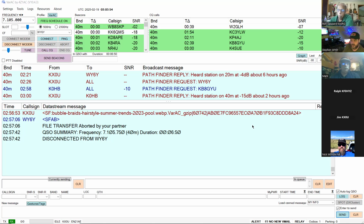But it's also useful if you use WinLink. The VARA HF modem is great for that. And you don't have to stick on these standard calling frequencies. You can QSY anywhere that data is allowed. And as long as you're not using the standard calling frequencies, you can switch to 2300 hertz and get some pretty fast throughput, as long as your path will allow it.